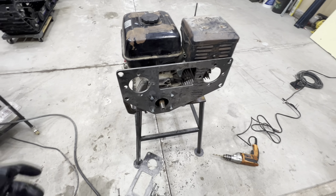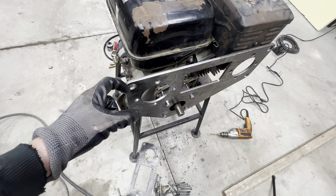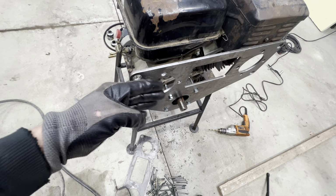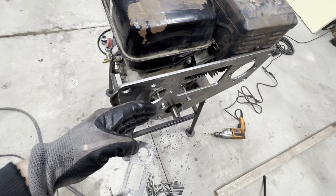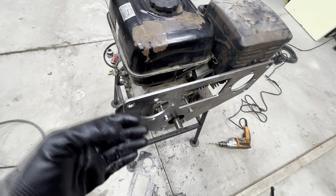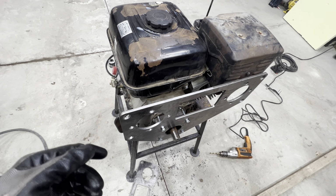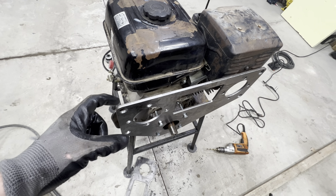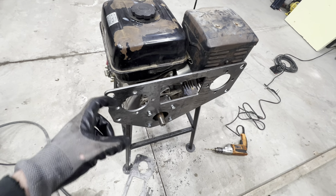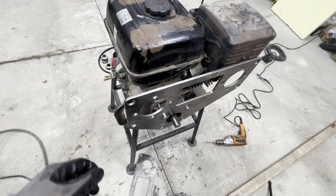The next step now is to cut some 7/8 pieces of rod and machine the ends down to 3/4. The goal is to get this plate and the pump mount plate somewhere between 2 3/4 and 3 inches apart. I want to go 2 3/4, but something inside me says that I always make things a little too compact, a little too tight, and I should probably aim for that 3-inch gap to make it a little bit more manageable. So yeah, I'll end up landing on 3 inches.